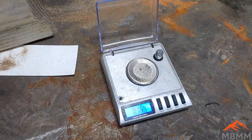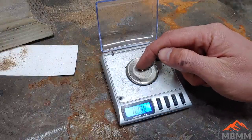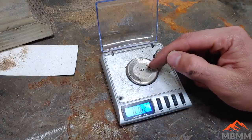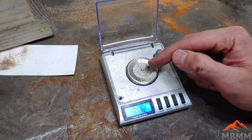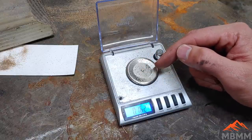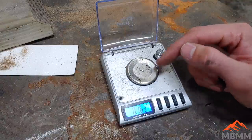And it weighs 0.165 or so, 0.16. Now, what I've seen in the past is that when you do have a little bit of the sulfides or matte that doesn't get taken up by the slag, the silver gets absorbed, but the gold is pretty much left untouched. So I expect that this is mostly silver, if not all silver, and the gold will end up capturing with the lead that we've run through all three batches.